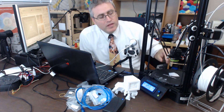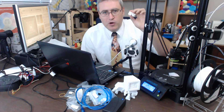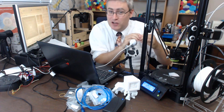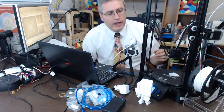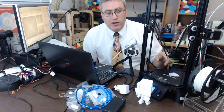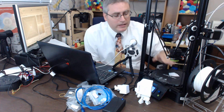So I printed the fan and installed it. Just changing that fan and clearing the path for the filament so it didn't have to pull as much made a big difference. I printed one last tiny pawn at full size and it came out solid. The corners that weren't looking good are looking much better — I think that was the fan. Overall, it was a much better print. Tightening the bolts, getting a better fan, and clearing the filament path fixed all of my problems so far.